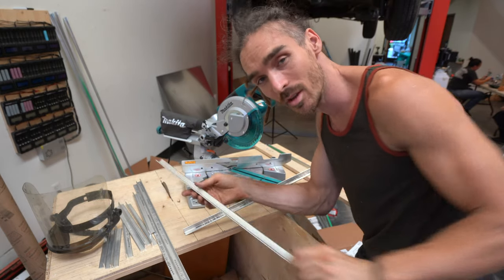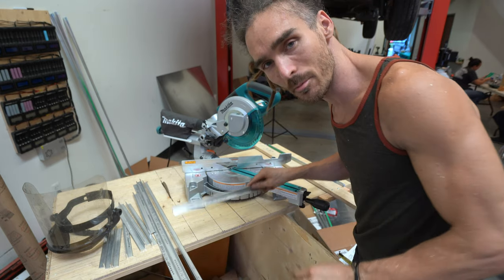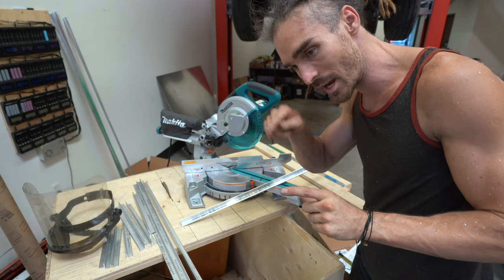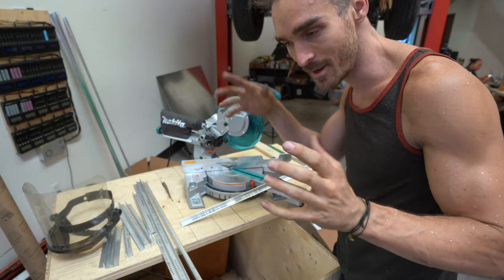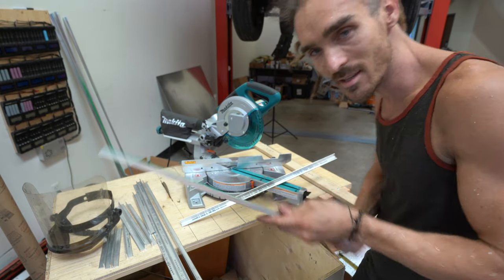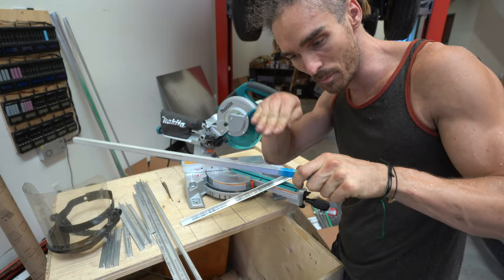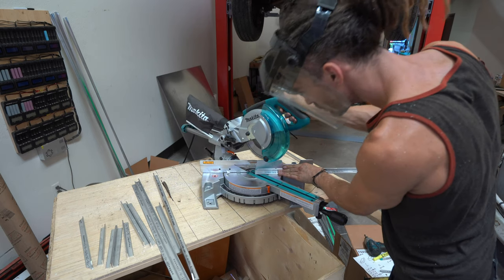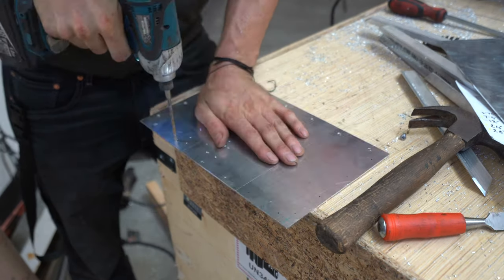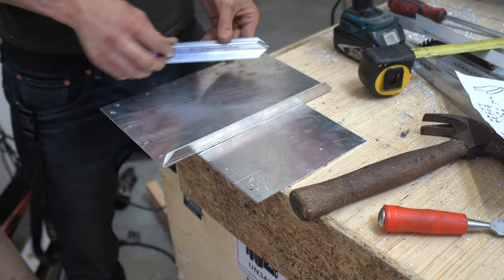I have cut to length the frame we're going to be building the box around, and now I am doing the 45 degree corners so they all fit together. Then I'm going to be drilling holes in the aluminium sheeting and tap in all the screws. Momentarily we should have a box built. Also, these are rails that are going to be halfway up the inside of the box for the batteries to rest on. I've cut all of the L bracket ends that we're going to build the frame of the box with. It's going to be difficult to keep the frame in place whilst we drill into it — that's what we're going to try and do now.